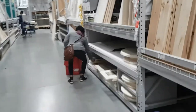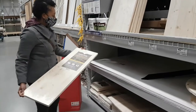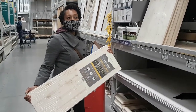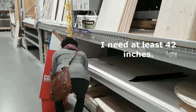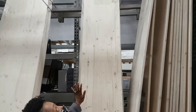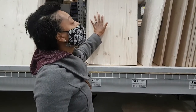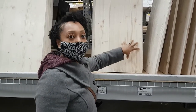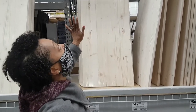Found what I was looking for! This is a stain-grade solid spruce wood panel that's already sanded — super easy to work with. I'd used it before for a client's home office shelving and knew it would be perfect for this install, except it's only three feet in length and I need it to be a little longer. This one is gonna work though — it's much wider than I need. I can get the 11-inch depth for my shelf and cut the remaining width to make new shelf supports. I can utilize this entire 16-inch by 72-inch wood panel for all my cuts!